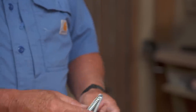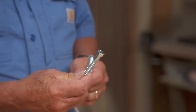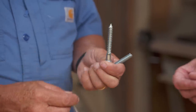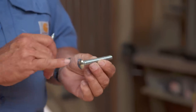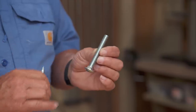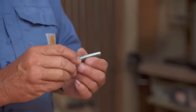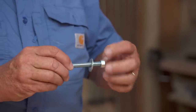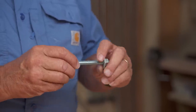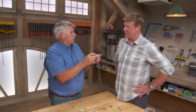There are a lot of different sizes and types. First of all, this is a lag screw, even though it has a hex head. It's meant for wood — if you look at the thread, it's a coarse thread, and that means wood. This is a carriage bolt. It has a machine thread, a fine thread, and there's no way to screw that into material, so you have to drill a hole and use a mechanical fastener — a washer and nut. That's great for screwing a post to a deck or two pieces of framing material together. Cinch that down tight and it's not going anywhere.